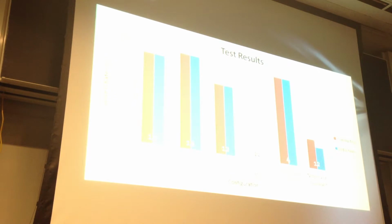So these are the results of our experiment. The nominal configuration is, as I said, just a flat Cave Crawler on a flat plane. Roll right, pitch up, pitch down. And the y-axis represents the success rate, where success represents a successful approach, engage, and power transfer of the electrical system, which required either the conduction or induction achieving power transfer, then a successful disengage and drive away. So you'll notice that the pitch down at an angle of 11.5 degrees failed every time. This is definitely notable, and we tried a less aggressive angle of 6.5 degrees, where of the 4 trials, it did succeed every time.